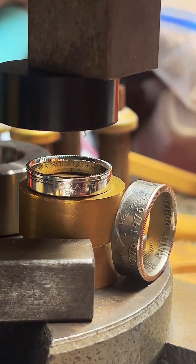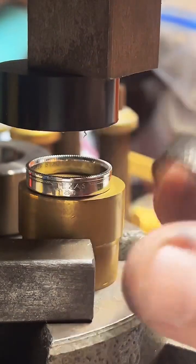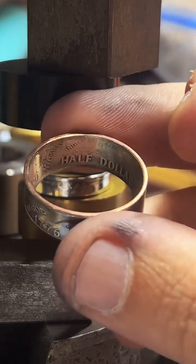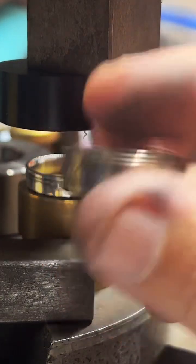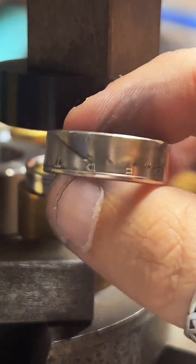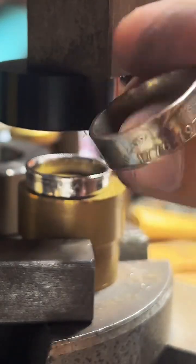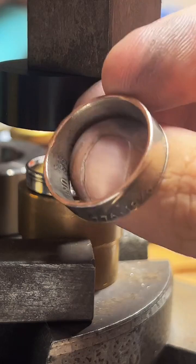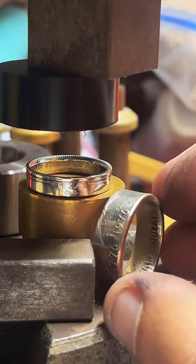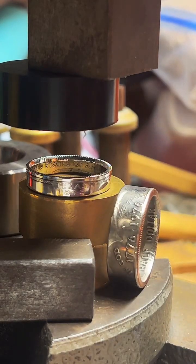So basically what he's asking is rings like this, which are made out of copper clad. You can see on the inside there, kind of that reddish copper color. If you wear this, it will oxidize with your sweat and the air and turn your finger green. It's not harmful. It's just kind of a side effect of copper. But you can put clear fingernail polish on the inside and outside and reduce that effect. So you just create a clear barrier between you and the metal itself.